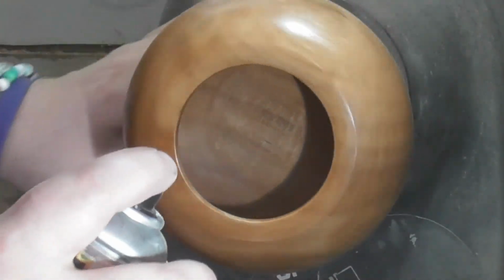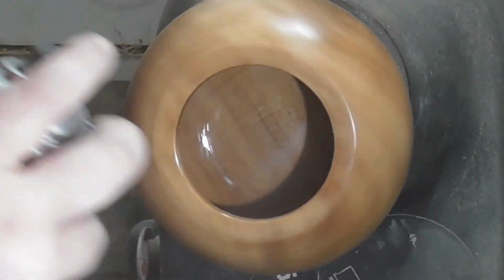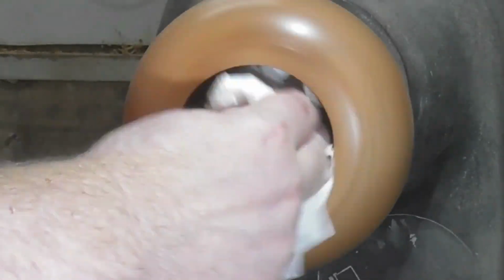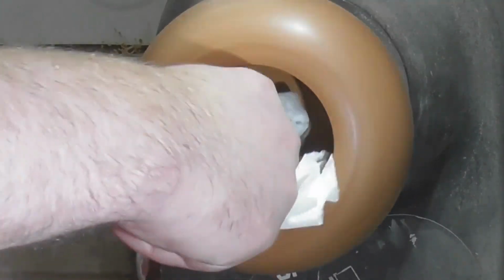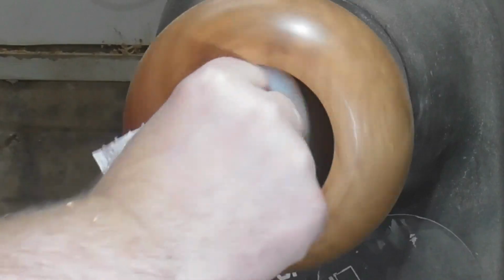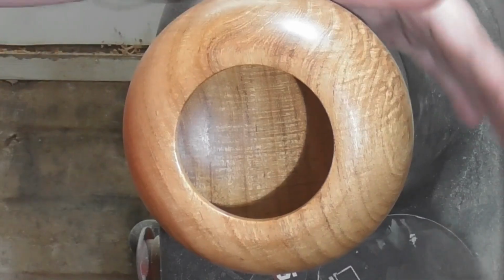Some matte sanding sealer. Some Yorkshire Grit Abrasive paste. Once again, exactly the same as before. Wipe this all over till you have a clean paper towel and you have the equivalent of around about 1000 grit. And last few wipes. And there you go.